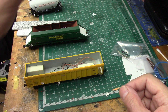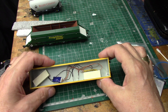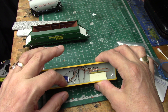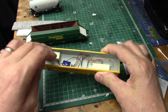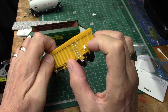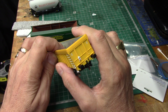The hall switch wires would need to come through the bodywork near the wheels, and as the wagon passed over the very powerful magnet supplied in the kit, it turns the lamp on — or off if it was already on. I just wanted it so that once power goes to the track, the lamp flashes. You can do that by joining two of the wires and doing away with one altogether. The lamp itself is absolutely prototypical — that's what's out there — even with the little shade over it. The only problem is it flashes too slowly.